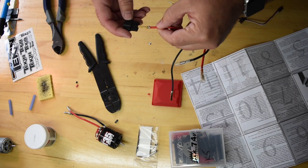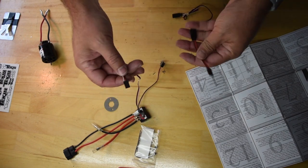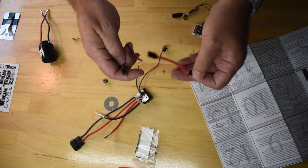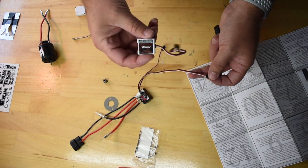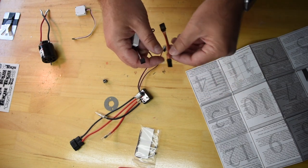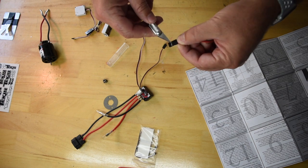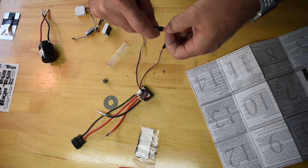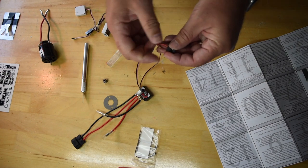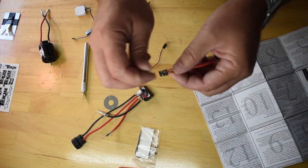The last thing I've got to do is put on the actual connector. Everything's set up. On the lead for this ESC I'm going to put a connector on. When I run the BEC I'm going to have to have the red wire removed. I still want to be able to use my hot wire, so I'm going to run a small lead — this way I don't have to worry about tampering with it, and I can just take the red wire right off the lead. To take the red wire out I just use an X-Acto knife — you've got to be very careful that you don't cut yourself. Just pry up the little plastic lock and then pull out the wire itself. Then I'll get some shrink tubing and shrink tube it so it doesn't make contact with anything.